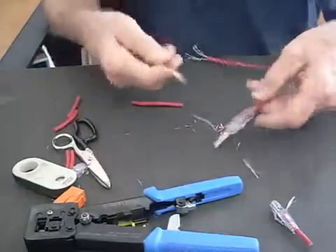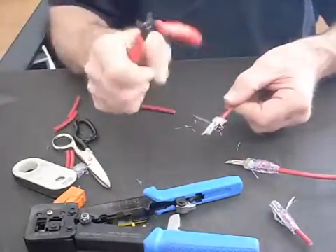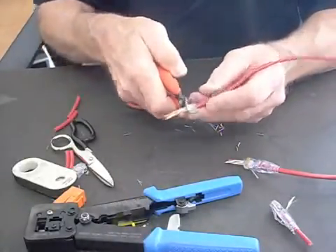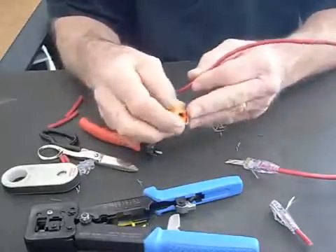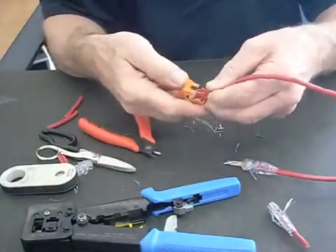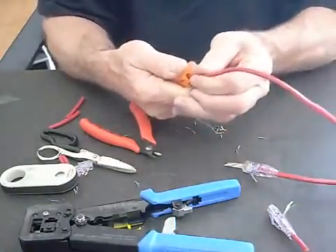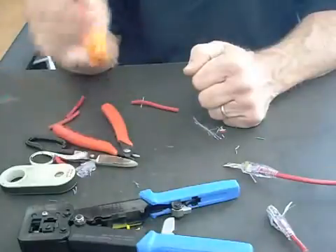Both preps are very similar. Now on the Easy Snap Jack, we want to take our flush cutter — it cuts flush against the surface. We come up right next to the bar and trim it just like that. Then take your snap jack, open it up, and slide that bar in. Notice how I'm holding it — keeping the pressure on while I get the contacts to perforate. Make sure the contacts are grabbing hold of the conductors before you let go so you get a good close connection. Once I have it like that I can finish it, and it's ready to plug into the wall plate.